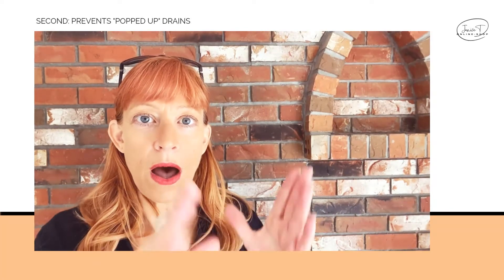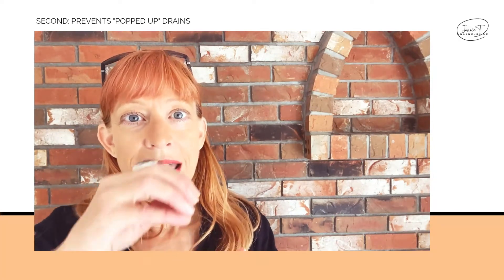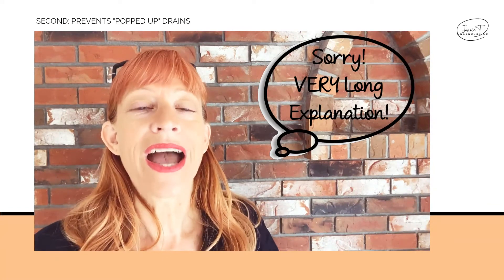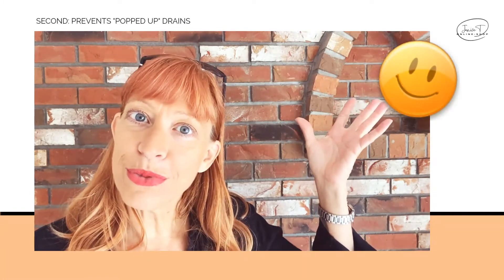So what's the difference of using this funnel system? Easy. When the tub isn't quite settled down, it doesn't matter. You put a few hundred pounds of water in, a person gets in, and it settles down just a little bit more. But because the tail coming from the drain is a friction fit down inside the funnel, it just settles itself down a little bit. There's nothing fixed that can't give. So when it needs to settle — same as everything else in a house, in a car, in our chairs — it won't matter. It just slips down in the tube just a little bit more, and you have saved so many dollars because nobody's going to have to cut through the ceiling of the room below to fix a bathtub.